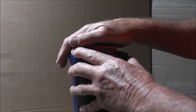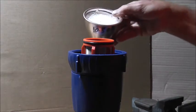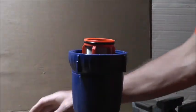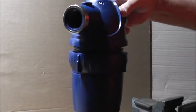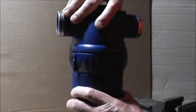Put the screen back in there and snap it in good. I've got ten and a half ounces of polyphosphate here that I'm going to pour in. I use a little funnel and simply pour the polyphosphate into the screen like so. Kind of shake it around, drop your bullet back into place, and screw the bottom back on. Very simple — you don't need to wrench it, just hand tighten it good.